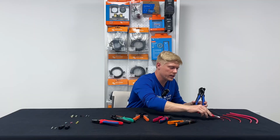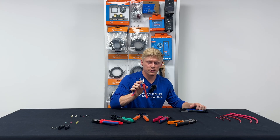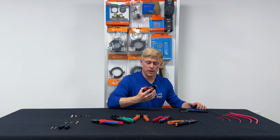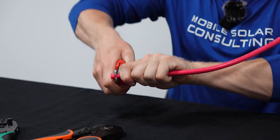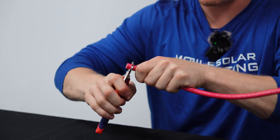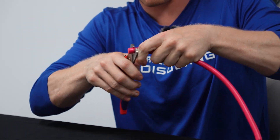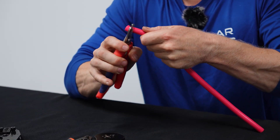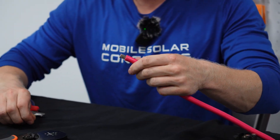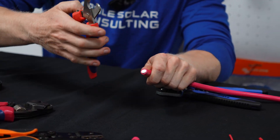We're going to be looking at 18 to 2 gauge wire today. You can cut any of those with this iCrimp wire cutter — or cable cutter, which is the proper term. This is about 10 bucks on Amazon and it can also strip wire pretty well. So we're going to cut this 2 gauge. I'm going to strip it and I'm not digging in too far — I don't want to damage strands. Once I've dug in a little bit I'm just going to pry off. Zero strands damaged in that process. And if we want to cut it, again up to 2 gauge wire — cuts like butter. Very sharp.